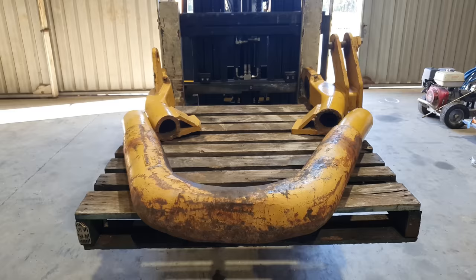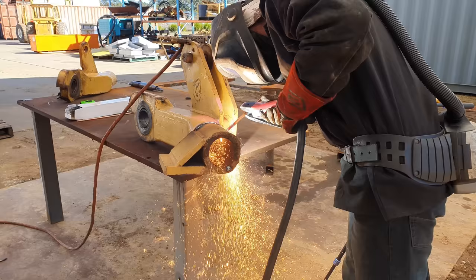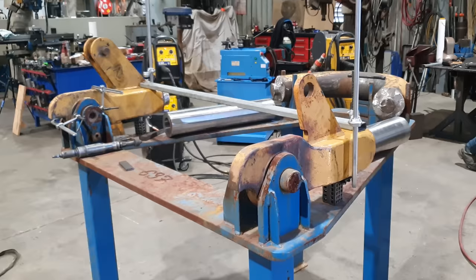Today is part two of our bayline repair. If you missed part one, there'll be a link in the description below. Go check that out. That's where we disassembled the bayline, gouged off all the broken material, and machined up our two new hollow bars. So now what I need to do is get the hollow bars set up in the jig and everything back in alignment so I can then start welding out the bayline.